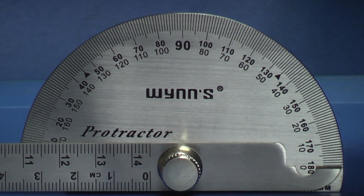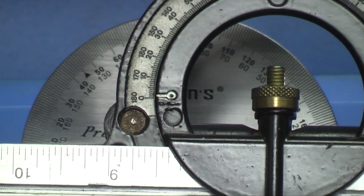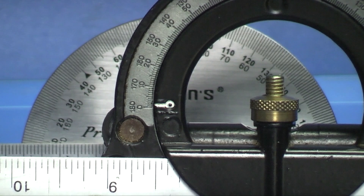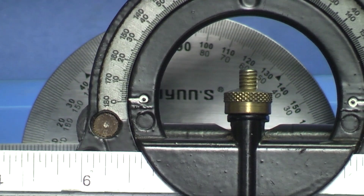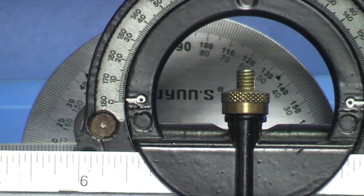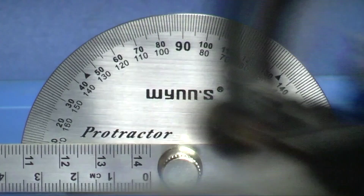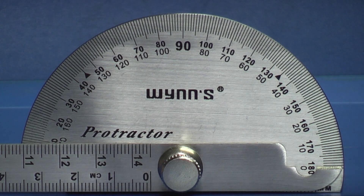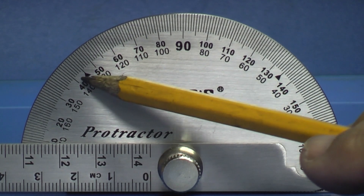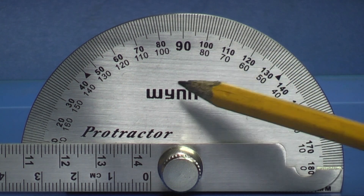If you compare this with one of the protractors that you get in the combination sets, you can see the scale on the combination protractor is not as clear. The degrees are thicker lines and the zero position is probably about 2 degrees thick, so it's difficult to get an accurate reading with that type. This one would just give you an idea of the angle. But the Winds one — you can see it clearly. It has a 45-degree mark on each side with a little arrow, 90 being in the centre, and it goes above and below 90 on each side.